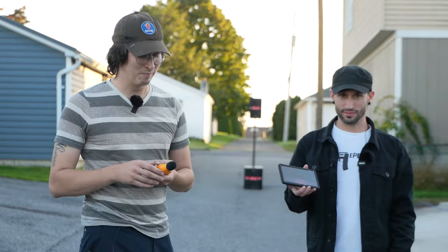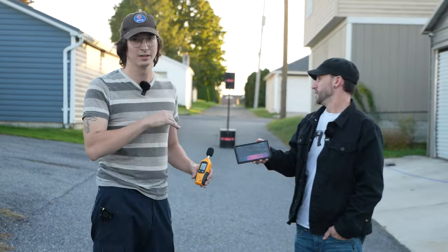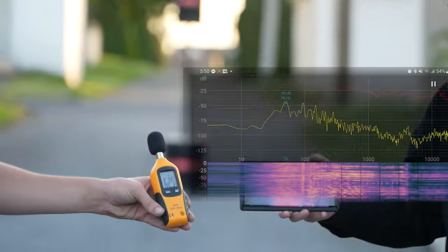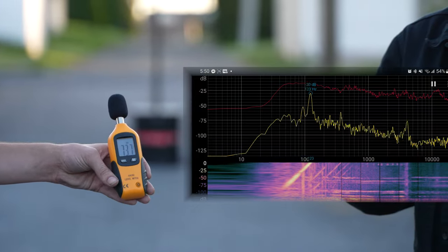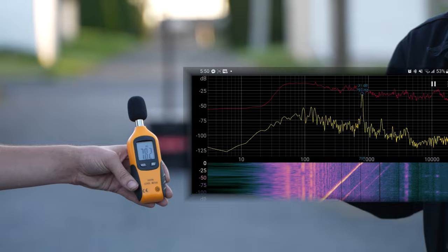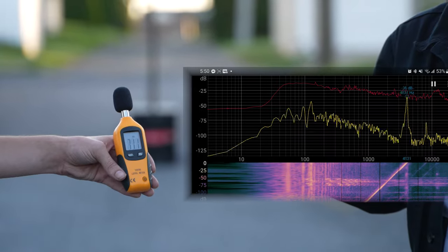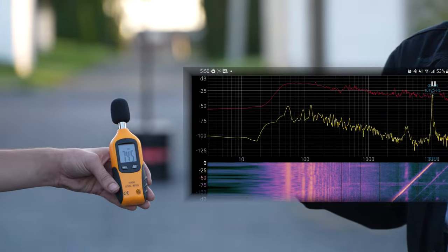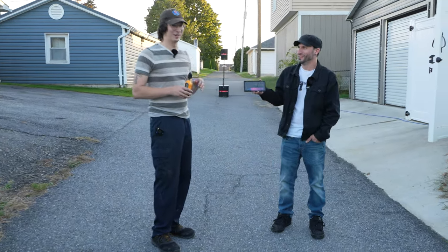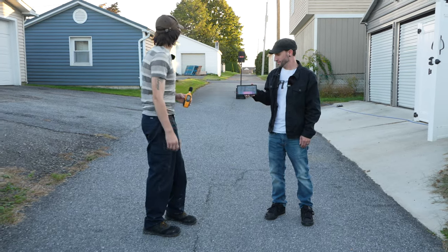About 35 to 40 feet away. So now we're going to do a frequency sweep to see just how the eight inch sounds alone. Again, this is with no subwoofer — just one top speaker, both the treble and bass set to noon and the gain about three o'clock, so about 75% gain. So there was really nothing from 50 hertz all the way up. For an eight inch top, 100 watts RMS, you can't expect the world, but there it is.